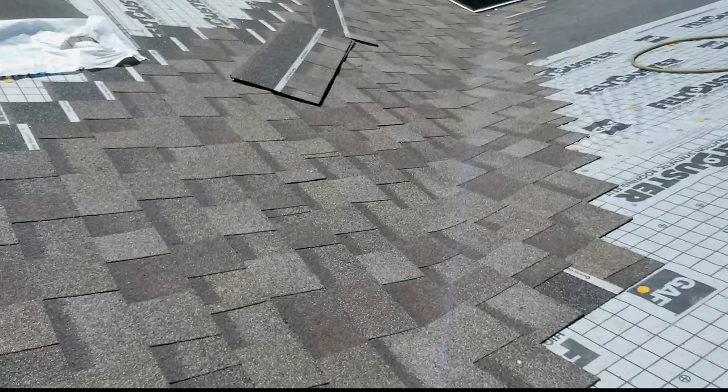But anyway, so you start there, and then your valley will eventually, even if you keep the same stair step, start to eat up too much of that shingle. So it'll continuously eat it up, eat it up, eat it up. And you'll see where I did my back step. You can see that I had about 2/3 of my shingle into the valley and only 1/3 of it on the side that I'm shingling. So that's more or less a waste of the shingle. So you've got too much shingle up in that valley. You don't need that much to keep it watertight.